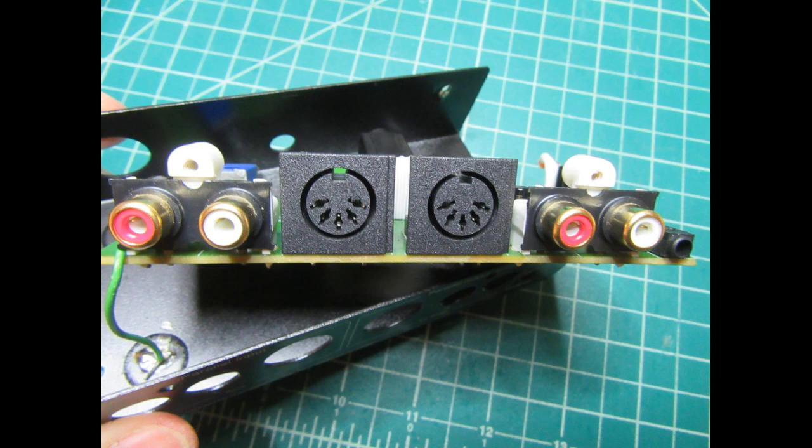Here you can see the two white protuberances above the RCA jack, which are actually blocks where the left and the right are all part of the same jack assembly, and those white protuberances are where you can put a screw in through the rear panel of the chassis to help anchor those in place so they don't put all of the connection strain on the circuit board pins.